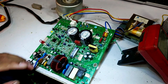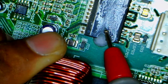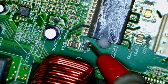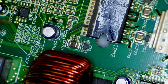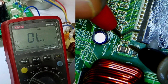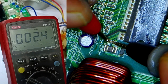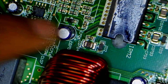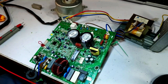There is a chance that the IPM intelligent power module might be short-circuited from the inside. It's possible that either the capacitor or the diode is short-circuited, causing the problem. Additionally, there's a small capacitor here which we should also check. I'll switch the multimeter back to continuity mode and test it. The meter shows a short-circuit at this point as well. This suggests there is likely a short-circuit somewhere — either the capacitor or the diode. There is a higher chance that the diode is faulty, so the first step is to replace the diode.